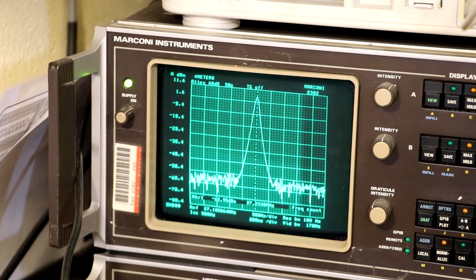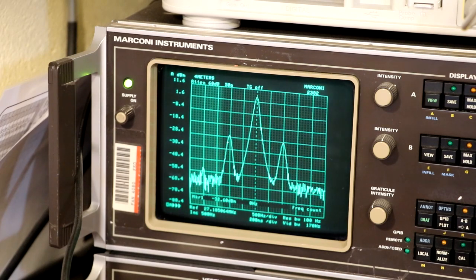See that? I've just turned the modulation down, and I'm going to turn it back up again. Got that set relatively high at 20 millivolts now. But what we're actually looking for is we need to zoom out in terms of frequency, because it's asking us to look at anything on the second harmonic.